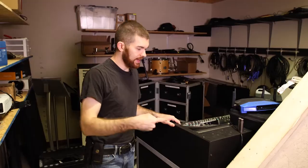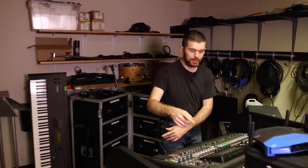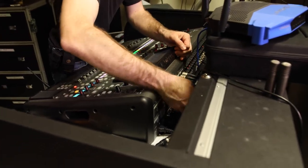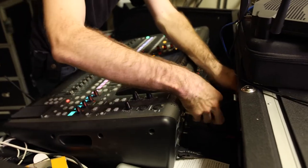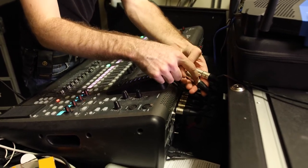As a musician, you should always build and maintain a good relationship with your sound techs. They have just as much if not more influence than you as to how the service flows and sounds. Here are the wireless transmitters for our wireless in-ear monitors, and on the back of them is an XLR cable. We're going to take this XLR cable and put a Y cable in it. In our case, it's really hard to get to the back of the wireless racks, so we're going to come up where the cable is coming out of the X32. We're using a console as the bus output — I'm going to take my mix bus, unplug it, plug it into a Y splitter, and then the cable going to the stage for recording plugs in as well, so the output goes to two places: the original destination and the recording.